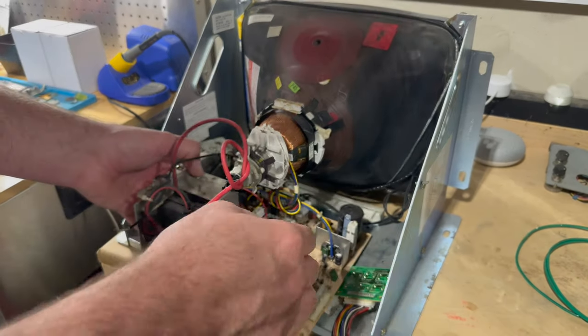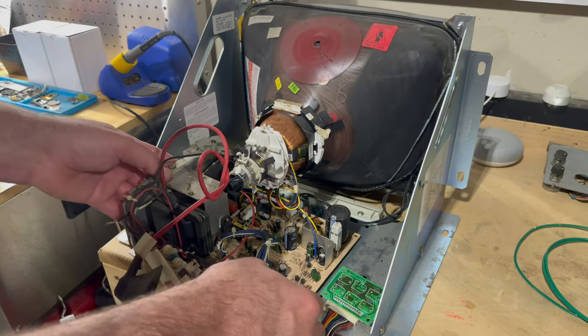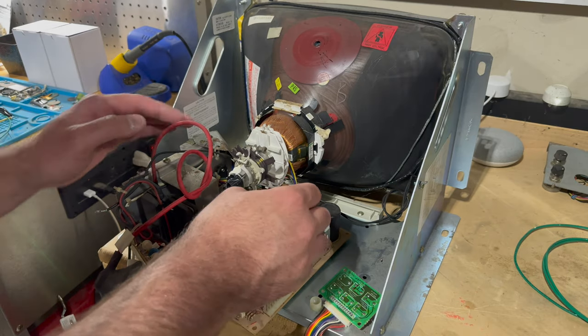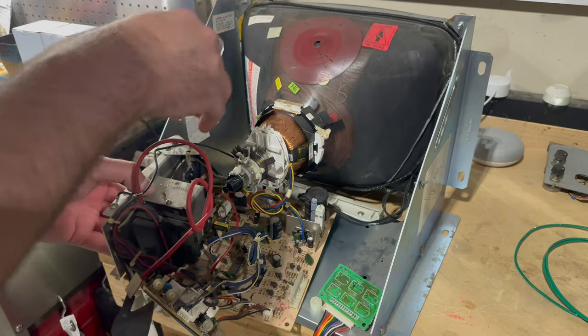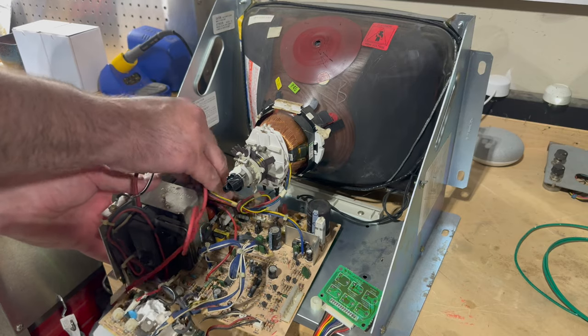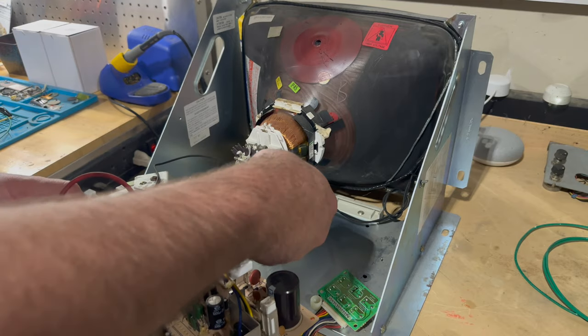the Earth's magnetic field and other things can cause weird rainbow colors and just screw with the color in the monitor. And then to come in and grab the yoke wires, which are tangled up here a little bit. I'll give myself a little bit more room so that I can reach in here and gently tug these off. And that's what connects the chassis to the yoke.